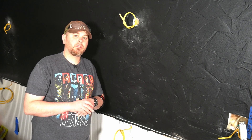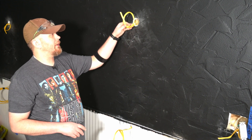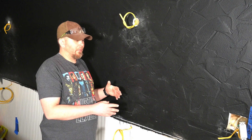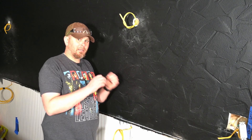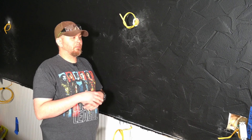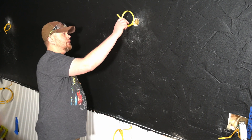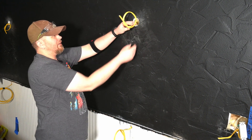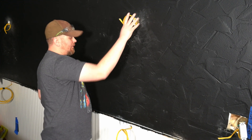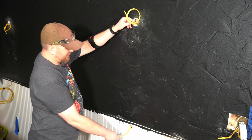A few final thoughts on electrical rough in: be sure to leave yourself plenty to work with — you can always stuff a little bit extra inside the wall if you need to later. That's especially important when you make the connections; don't make them so tight that you can't fix or change them later. Leave yourself a little bit of leeway. When you do rough in, I like to tie a fairly large loop in the wire end and twist it a little bit so you won't accidentally pull it through the wall and have to re-fish that line later.